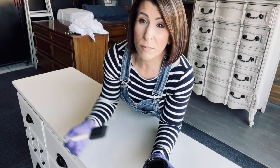I have my stain and finishing oil in cappuccino and a foam brush — that is all we are going to be using aside from rags, which will come in afterwards. This stain and finishing oil has an open time of 10 minutes, meaning you can work with it for that 10-minute period before you need to stop, put your foam brush down and walk away. I'm going to zoom in as close as I can so you guys can see my process and how I get this big long dresser all taken care of in one swoop.